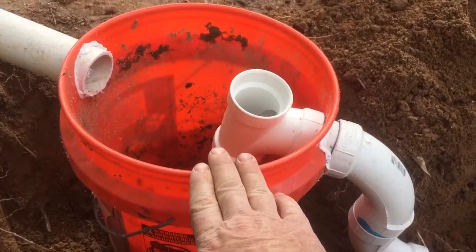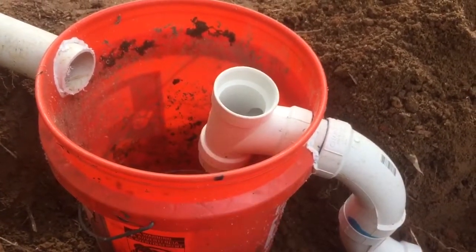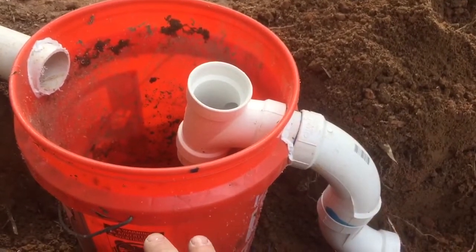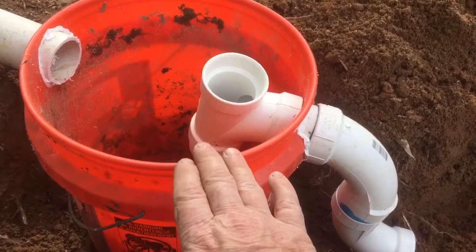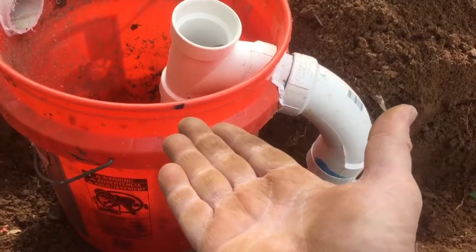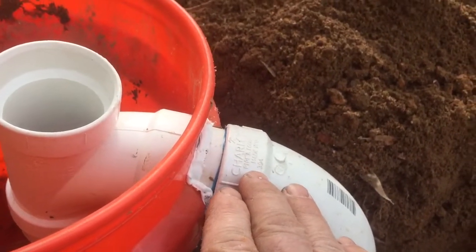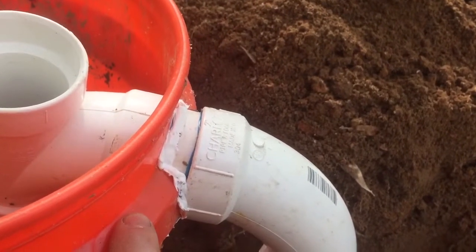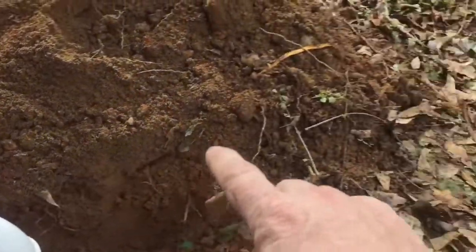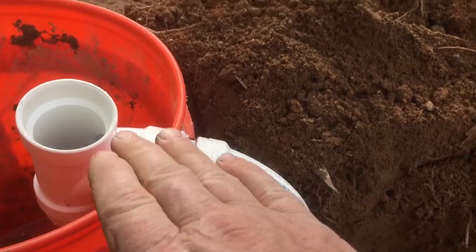We need to talk about where to set this bucket. You want to set it close to your house or cabin. How high the bucket sits — whether it's under the ground or above — depends on the grade of your property. If it slopes away from the house, you can bury it totally underground. If the ground is pretty flat, dig a hole but raise the bucket up a little bit so that you have good flow from the exit pipe. The exit pipe must be higher than where the water is finally released.